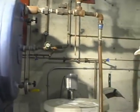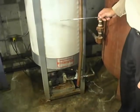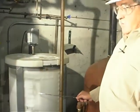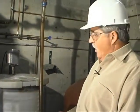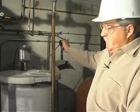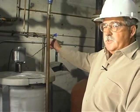At the same time we're going to pump chemicals from our chemical feed tank to raise the pH, the phosphates, and antifoam of our feed water. We have to batch this process — add water and agitate it with this agitator.